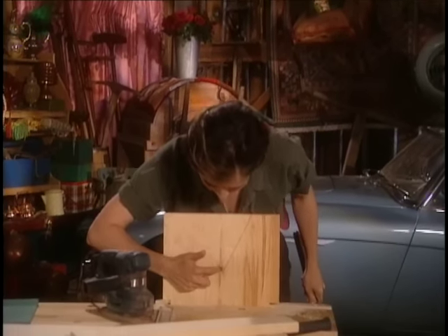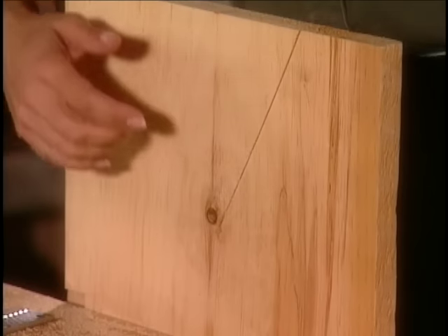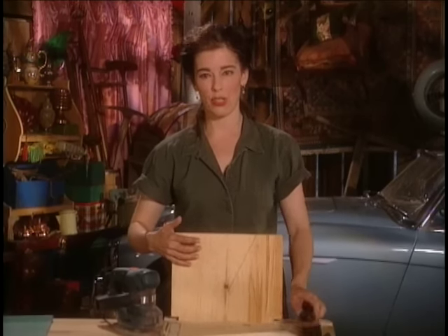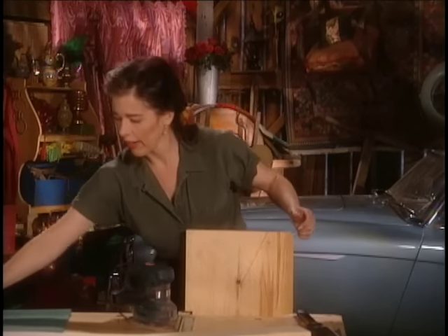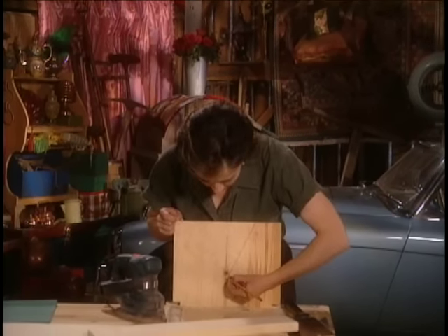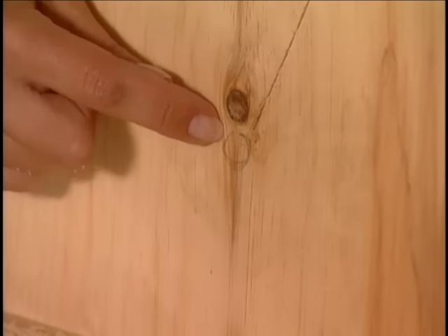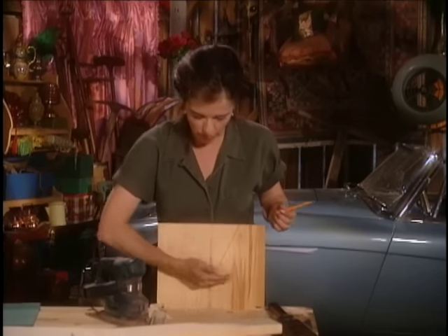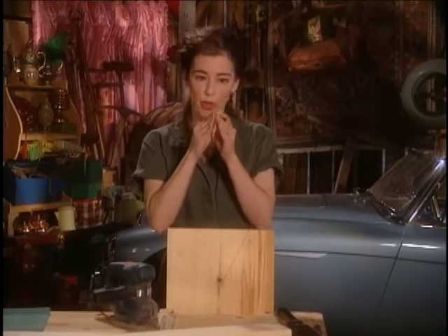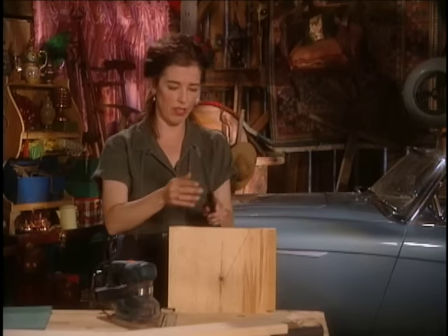See how I'm coming out almost right in the middle of a knot? That's worrying me a little because that knot's going to want to split right up. A way around that is to take a drill bit and drill a little circular hole right there, because that will stop a split from wanting to happen — you round it out so that there's not so much strain on one little tiny point of the angle. I'll do that after I've finished the other V.